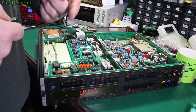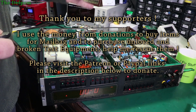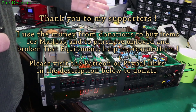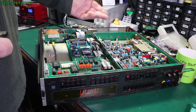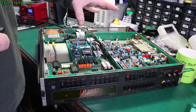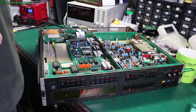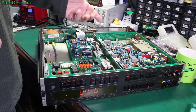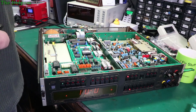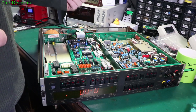I had an issue with the other unit - one of them had a blank EEPROM for some reason, which I thought was a bit strange. So I was looking at the diagram trying to figure out what's going on. The EEPROM is on the same bus as the main processor ICs on the other board, so they're all in parallel together. It's not the other devices because the rest of the unit's working. When I know the EEPROM is read, it's a bit of a mystery. Anyway, I looked at the board layout...